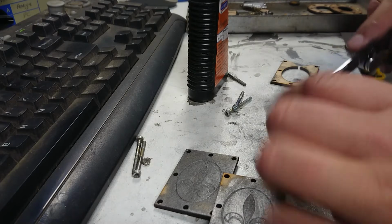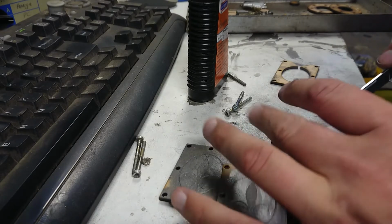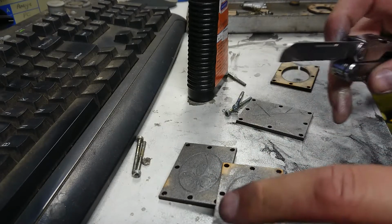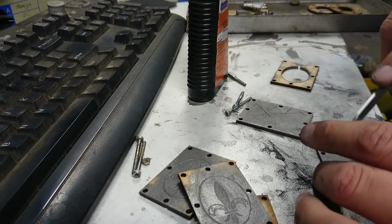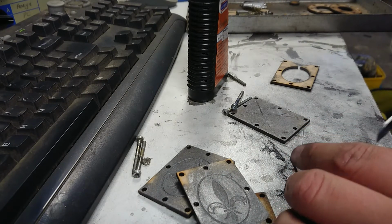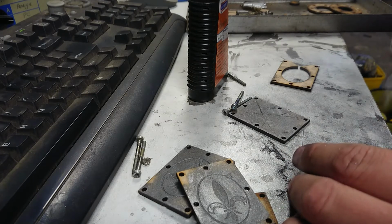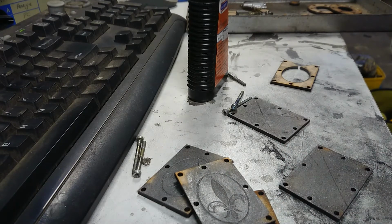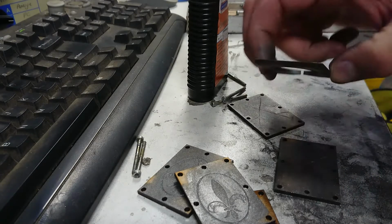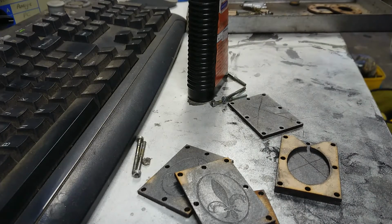One little trick I've learnt with this is to get the air gap out of them. I've had to do a few scrapes with a knife just to let some air out because I haven't left a venting sprue in these. And I rarely do for such small things. I rely on just having a fairly hefty amount of metal sitting on top. I might not be able to get away with this with brass, and it's probably not as dense as the metal I'm used to dealing with. So yeah, these little scratches usually provide enough of an air gap to let the air escape between the sides of the mould.